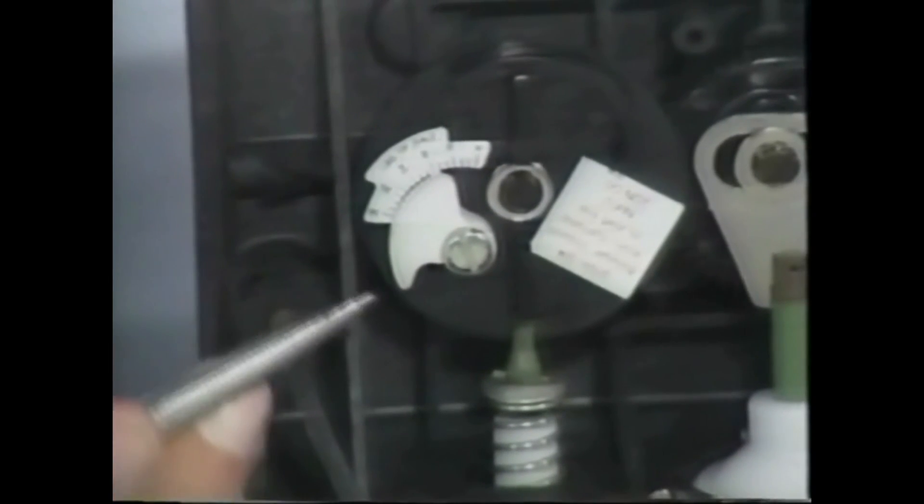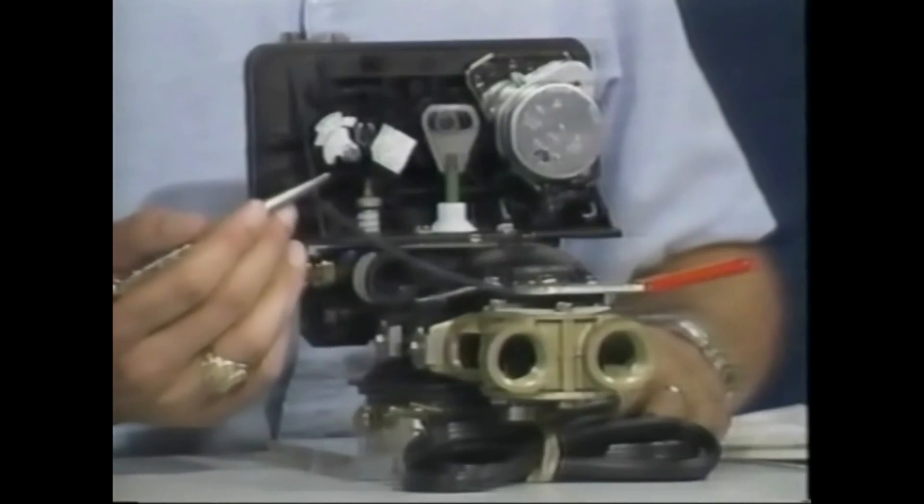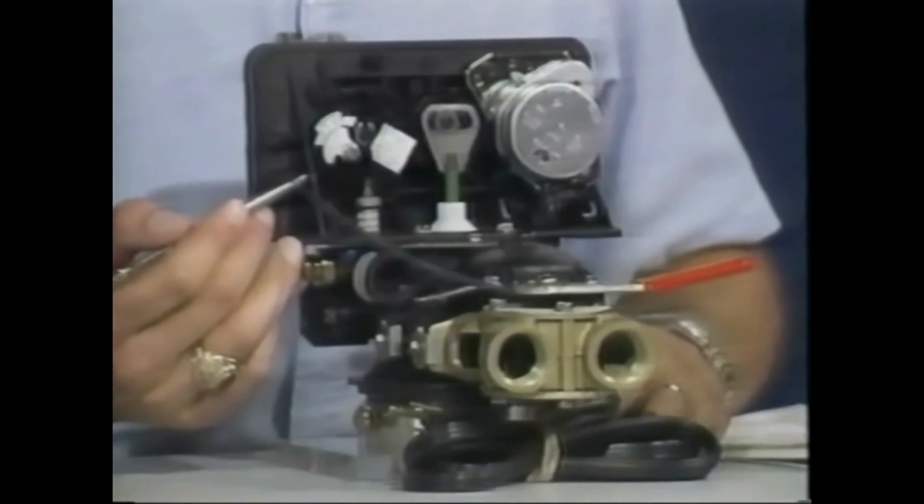Whichever label we have, we must select the position for the white lobe pointer so that we know the volume of salt used per regeneration. How much salt should we use? That's really a question of how much resin or capacity by volume there is in the tank — for instance, in our example of a cubic foot unit. Let's use 8 pounds, since that's a fairly universal medium salt setting.